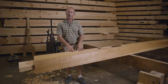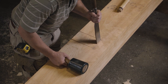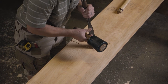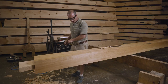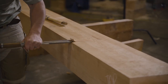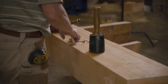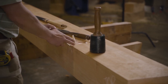Now that I've completed the saw cut, I can transition to chiseling. Where I have not sawn, I'm going to just chisel down the outline of the mortise, and then I can start chiseling in. I gave myself a relief cut down the middle of the mortise, because it's tapered out like this and sometimes this waste gets wedged in there.